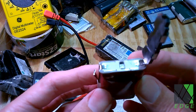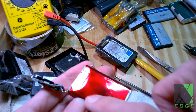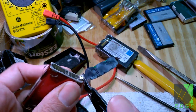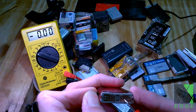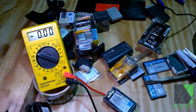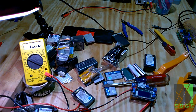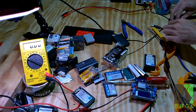I'll go ahead and cut the bus bar to protect myself. The cell looks reasonably unharmed — nice to know these are Japanese. They might look the slightest bit bulgy. I'm just going to cut off the battery protection and give it a measure — not really getting a lot there. Looks like these are flat dead, so I might not be able to use them. The curiosity got the better of me — I'm going to see if I can put a charge in this one using my little mini bench power supply. I just set up this other workbench to be a battery processing station.